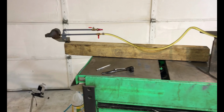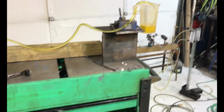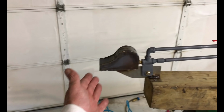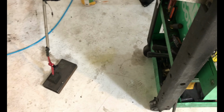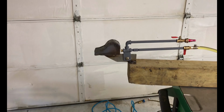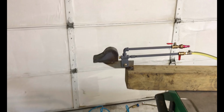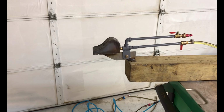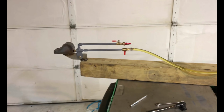So just something to recognize if you're having trouble with your oil burner. It may just be as simple as you don't have the fuel elevated enough. One way to know: if you don't have oil dripping out of the front of one of these things when you're trying to light it, you don't have enough fuel. That is an immediate telltale sign. There's a little bit of a puddle of diesel right there. Typically, that's one of the master rules: during ignition you should see a couple of drops of fuel drip out, nothing more. But I'm babbling at this point. Shutting up.